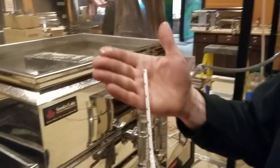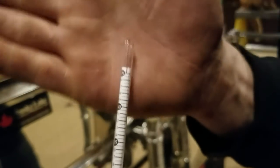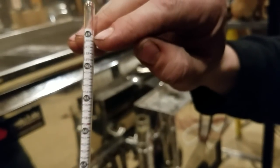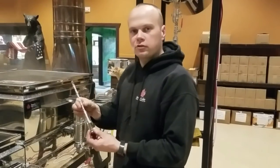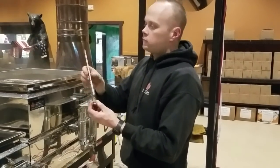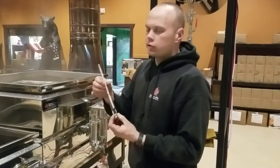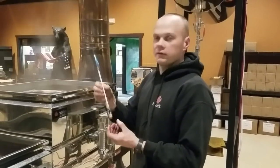The biggest advantage of this gold series hydrometer is that it has a reference indicator — a red line cast into the glass. That line extends down to the 45 mark, the top line of the scale. So if that scale ever slides, as the hydrometer ages, the adhesive may let loose. It's an age-old problem with hydrometers. At least if the scale moves, you know you can't trust the hydrometer or you can compensate for it. Best of all, you should replace it if the scale doesn't work. It's been a huge success for us — we just love this hydrometer.